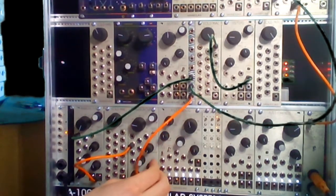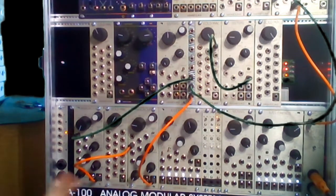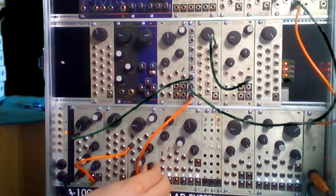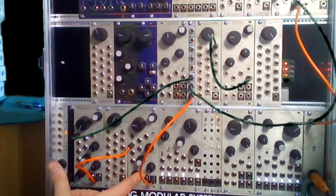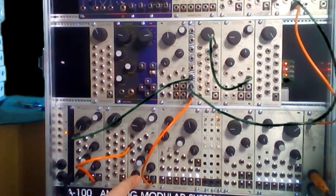But it really just gives you a different characteristic when you're doing this kind of feedback stuff, and it's usually a little more subtle. In the bass frequencies, though, the linear effect is stronger. Because you can think of it, you're adding a fixed amount of hertz. So if you're operating this Mangrove at, you know, 2 to 10 hertz, then any linear amount is going to be significant.